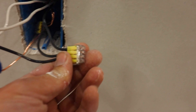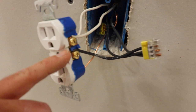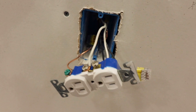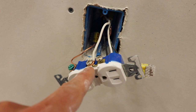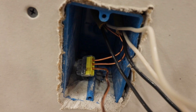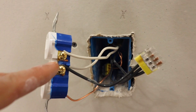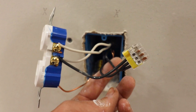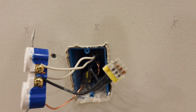Right here we have broken the metal tie piece that connects the two brass screws — it's off, so now these two are separated. We only have one neutral going on the neutral side, and that's okay because these two screws are still connected by the little silver tab, so they both have a neutral supply. We have our ground — all pigtailed together just like our blacks. There's one white up here serving as our hot to supply the switch side. This black and this white wire are with the same cord, the same circuit. The power from this is going to travel back down through the wall and power through this white wire.